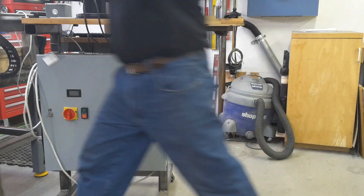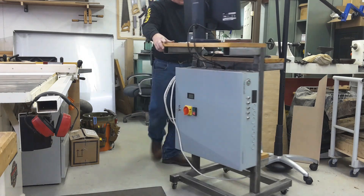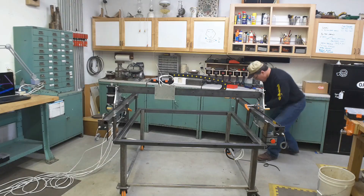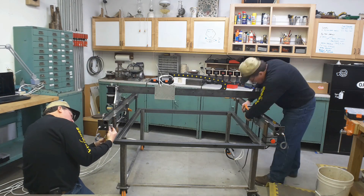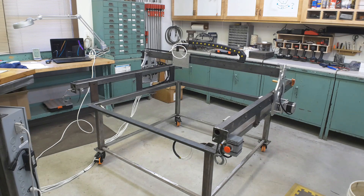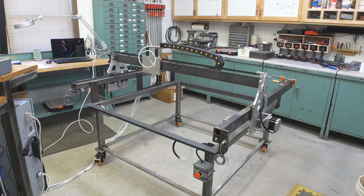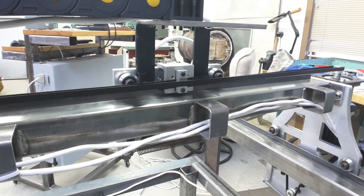Well, there's nothing left to do but try it out. Here's where some of my original design starts paying benefits — I unplug the cables off my router, wheel the podium over to the plasma machine, plug it in, and it should be good to go. I've got to hook the drive belts back up first. And now the moment we've all been waiting for — three, two, one. I'm using Mach3 for my controller software, and after a little bit of fiddling and doing the math about four times I think I got the number of steps to travel distance correct, and I started a test program running.